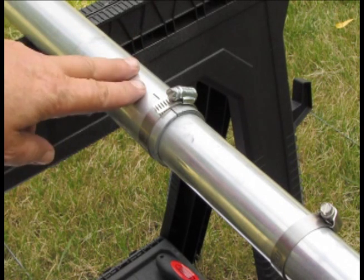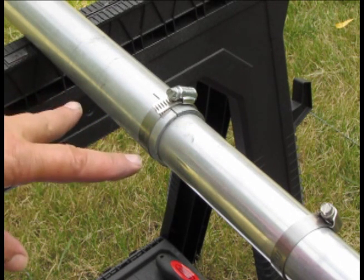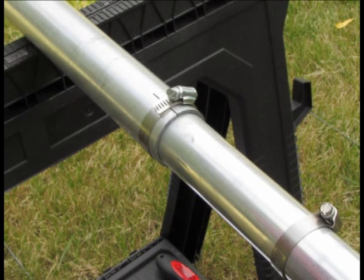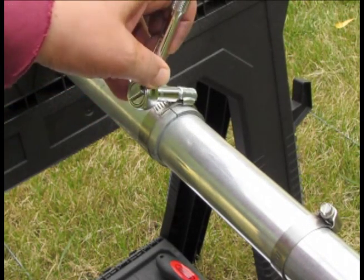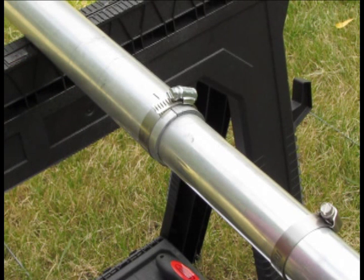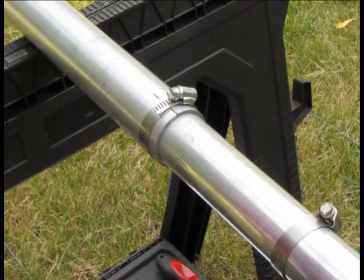This tube is the one that needs to be adjusted in length — the one that telescopes into the 2-inch tube. I had to adjust the length by shortening it. It went down 2 inches and that brought it up about 100 kHz, so we shortened it 2 more inches and that hopefully will bring it right into range. I have to caution you that this tube has a thicker wall and therefore a little more torque is required to compress it over the telescoping section. I damaged my first clamp so I had to go out and purchase another one, so heed the caution in the directions about over-tightening these clamps.